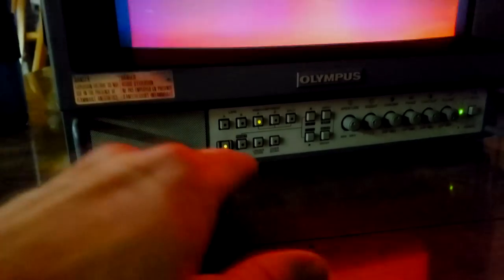This magenta corner — that's a magnetism issue. If you look up at this corner, same thing. The magnetism is causing a discoloration in those two corners. There's a degausser built into this monitor and we can try to use that to clear this up, but it's just not strong enough. So that's one issue we're going to have to try to repair with our magical degaussing wand.